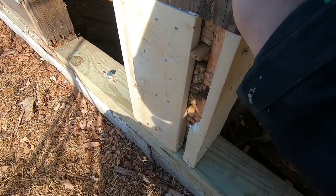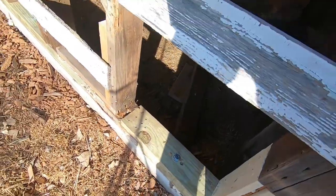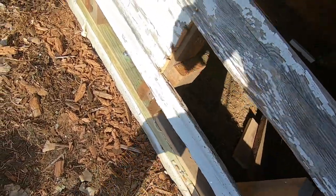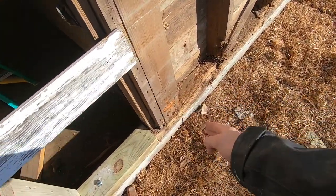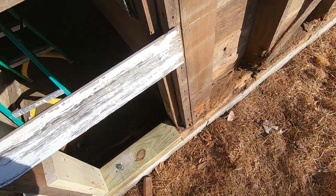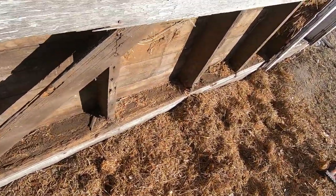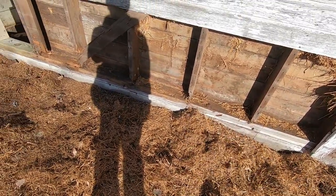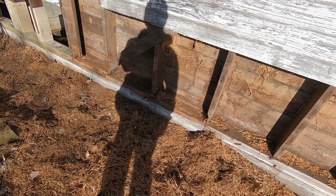Here's my column coming down, using construction adhesive. Here I did this little scarf joint. But here's another column. The floor joists are running this way, so essentially the wall to the columns to another wall. But I have to cut out about 8 feet here and scab in all those studs. And then I got 2 let in braces I'm gonna replace. And then we'll be good to finish the siding on the back.